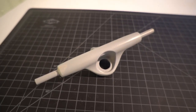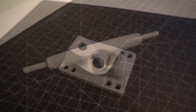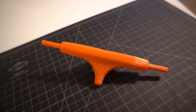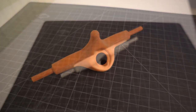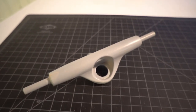Let's start with the parts of the truck. There are two metal parts that I need to cast: the hangers, the part that holds the axles, and the base plates, the part that gets attached to the deck and allows the hangers to pivot. I 3D printed my bucks and then sanded them down to 220 grit, hit them with a coat of filler primer, sanded them again, and then buffed them smooth.